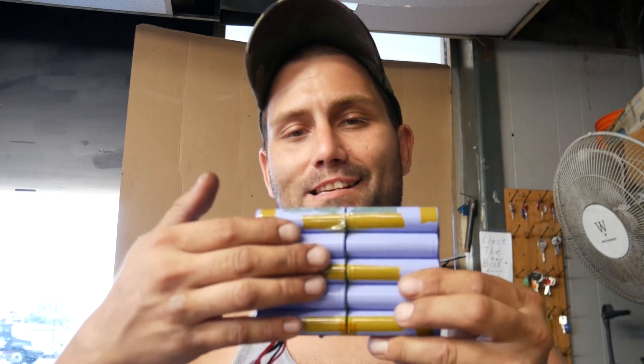I have had that happen with battery packs before. So be very, very careful about where you're working with these, what's around you, and what you could possibly touch them with. Not too long ago, I just finished putting together a 40-cell battery pack and I shorted it out because I was being careless. The first obvious thing you're going to see inside your battery pack are the 18650 cells. As soon as I opened it up, I noticed these are your typical Samsung ICR batteries. ICR is the type of battery — this basically refers to the level of protection each individual cell has.